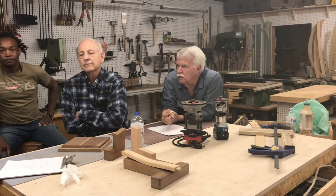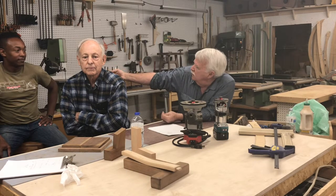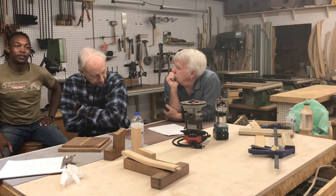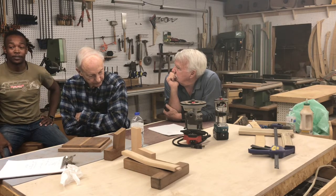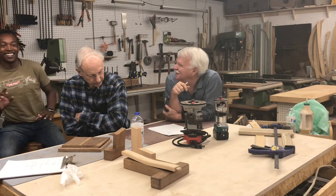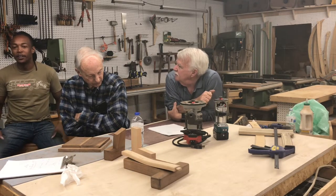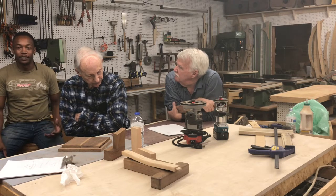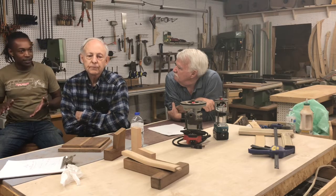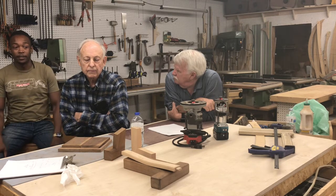And again, I would lean towards the Festool. Tell us about your experience with the... It was a Triton. I tried the Triton Track Saw, which is significantly cheaper than the Festool Track Saw. But to be fair, I was working with killer lumber, literally. The naturally salvaged lumber, dried naturally, some of it is really dense, and not every species of wood has that even grain density. So to be short, the lumber I was using killed the Triton Track Saw.